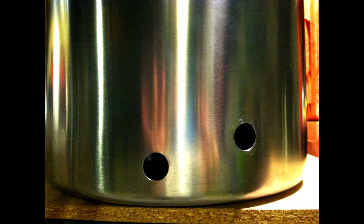So when it comes to actually drilling the holes in there, you basically need an 1/8 inch drill bit to start your initial hole, and from there you use a step bit. And I believe I needed 13/16, and I think that's probably pretty standard. I'd for sure verify that, but that's what you want to go down to. Then I use some coarse plumbing sandpaper, the kind that plumbers will use to clean up the edge of a pipe.